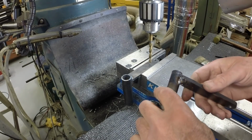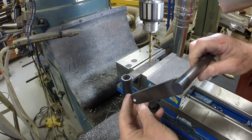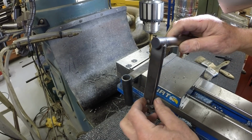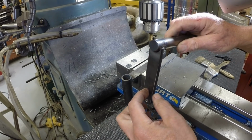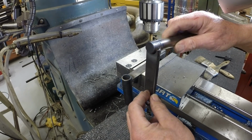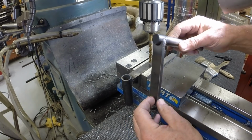I'm concerned that the control arms will move too much. That is, if I only need 2 inches or 1.5 inches of movement at the trunnion, I won't get enough movement at the top of the control handle with this being 5 inches down.